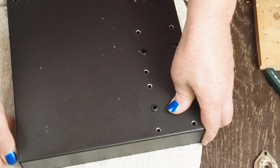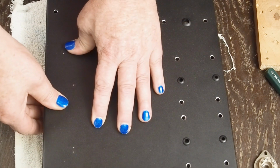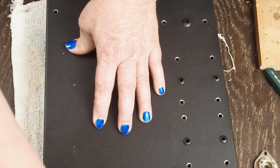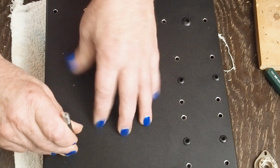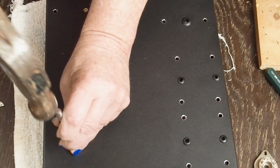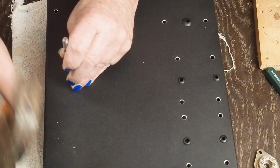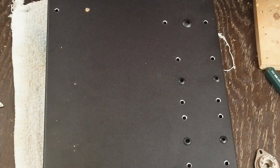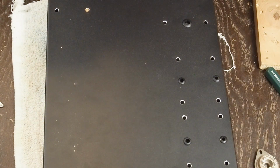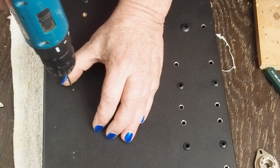We'll go ahead and take the volume pot out, because we know where it was. And then after removing the volume pot so that we don't damage it, we'll come in and center punch our 2 front tube socket holes. And we got those ready to go. So next we'll drill a couple of pilot holes and then double check our measurements.